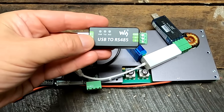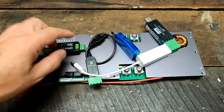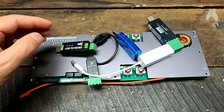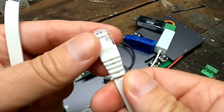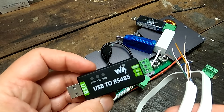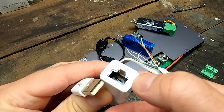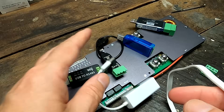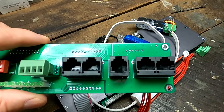Tonight I want to show you which USB-to-RS485 adapters work with the JK BMS, how to connect them, and which chip they have inside. We'll open all of them and look inside. We also need a normal LAN cable — I've prepared one by cutting off one end and stripping the individual wires. Some adapters come with only a screw terminal; others have an RJ45 connector, meaning you don't need to cut your cable — those are preferred.